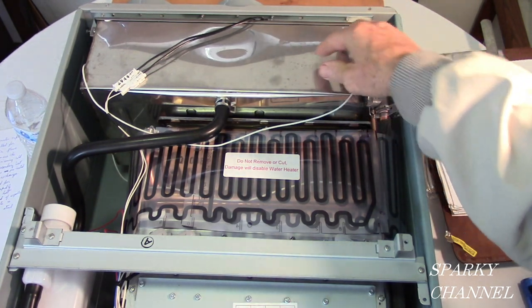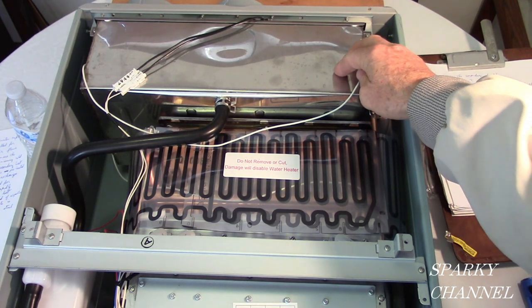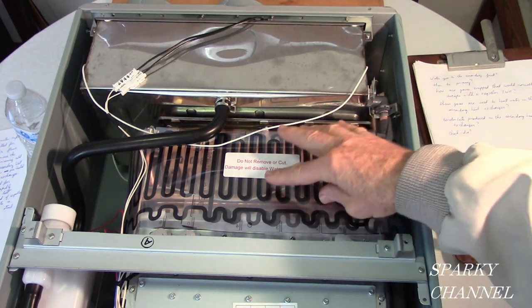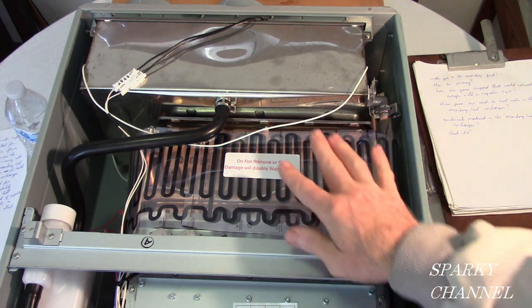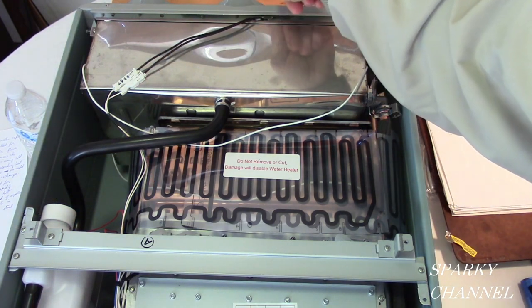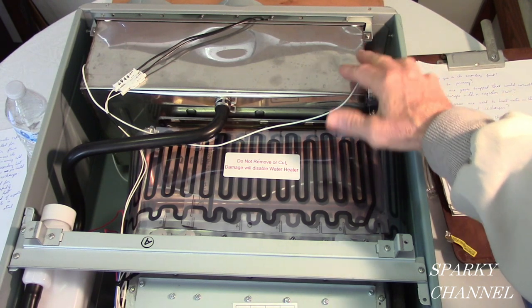It's very important that it be stainless steel. So it goes through here and the water gets preheated, and the preheat is ingenious. It is preheated by the excess gases from the primary heater. You see, we got the burner going, and we got the excess gases that normally leave right out the exhaust vent in a normal tankless water heater that isn't condensing.